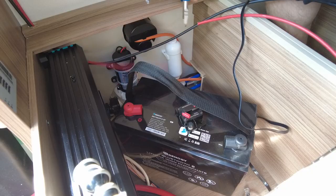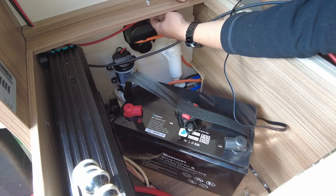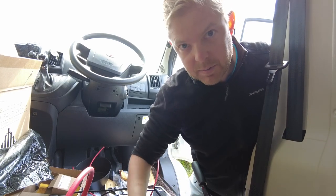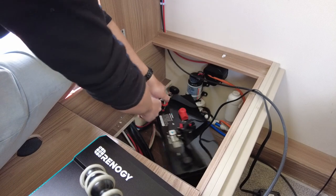I'm going to prep the cables for the 260 watt panel coming down into the battery compartment. I incorrectly ordered the wrong amp breaker, so that's not going to arrive until tomorrow — so I can't actually plug it all in yet. I'm going to start putting some of the connectors onto the batteries so we can start getting close to terminating some of these cables. We want to put longer screws on the top of these.